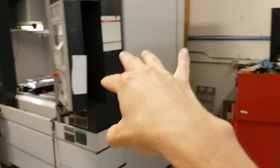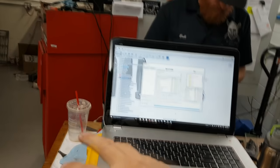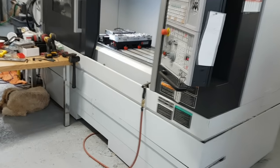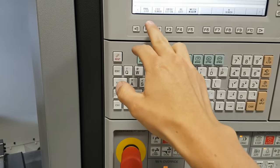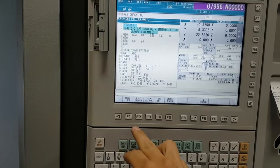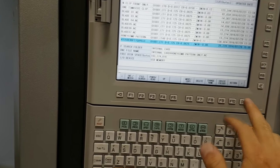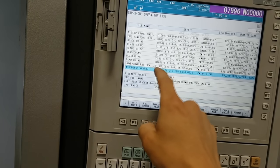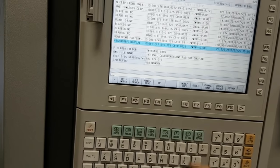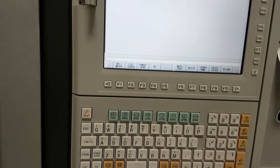Everything posts to a certain folder. Mori Connect sees that as the most recent file. I just click that little button and it transfers over — thinking, thinking, thinking — going through the air to over there. The computer is wireless, so it goes into the ether, into the router upstairs. The machine is hardwired with an Ethernet cable to the router, so the machine's not wireless but it's connected. To access it here, I make sure I'm in the DNC section, go to program list, click up because it's at the bottom of the list, and there it is — random numbers. I'm always opening the most recent file. I click up, then click Input, and now it's ready to go.